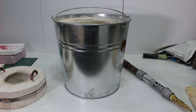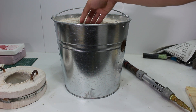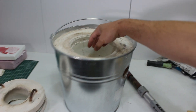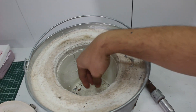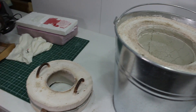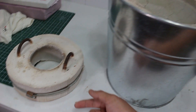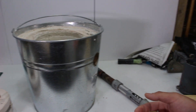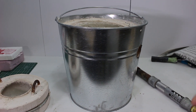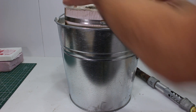Inside I've poured some refractory made out of a plaster of Paris and sand mixture. A chamber was made inside, and that's where the crucible sits. There's a lid made out of the same material with two u-bolts so you can remove it with tongs once it gets up to temperature. The only problem with this stuff is it has a tendency to crack, which is why I have this clamp on it.